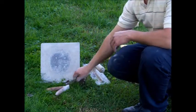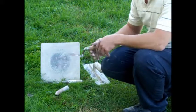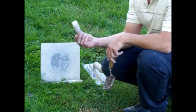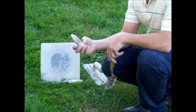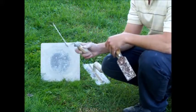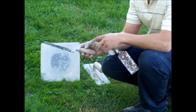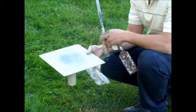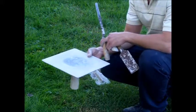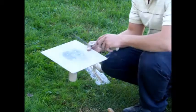A few other tools you'll need for this process: a margin trowel for scooping out your cement and occasionally doing some patchwork. This is usually referred to as a baller — basically it's just the end of a broom handle cut off about the size of your palm, and you can use it for tooling joints to give them a water runoff slope. You also want to have a pointer, which will allow you to push the cement in between each of the joints while you're repairing. The most important piece is the mudboard — this allows you to put small amounts of concrete on the surface and take it with you to fill in any spots you need.